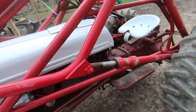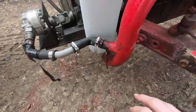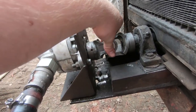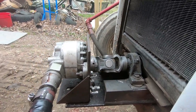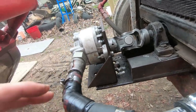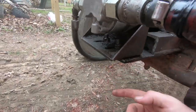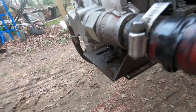Check these guys out. I'm going to shut it off now so I can talk to you a little more. You do have to keep an eye on your bolts — keep tightening them and use Loctite, because they will get loosened up when you first run it. I've tightened them up a second time and I'm going to run it a little bit more then tighten them again, just so these don't slide back. These bolts are hardened bolts with washers underneath — I've tightened the crap out of them to where they started biting down into the steel.